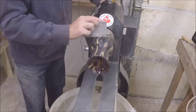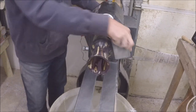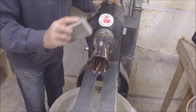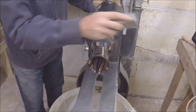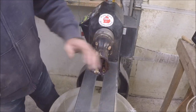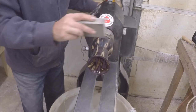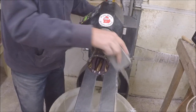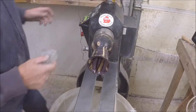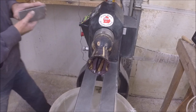All thinking, what the hell is he doing? I've been struggling with finishes. Lacquer finish works the best. This stuff I know how to use. I know I did use the Yorkshire grit and the microfine on here, and I did clean it with denatured alcohol after that to get any kind of oily residues or anything off that may have been left behind, so that my lacquer sticks.